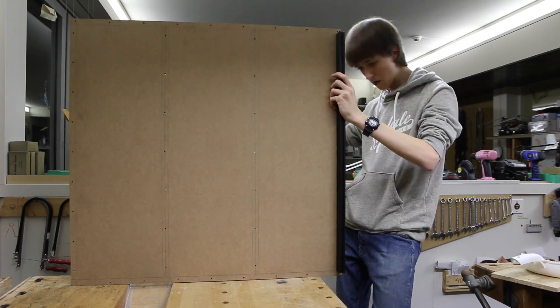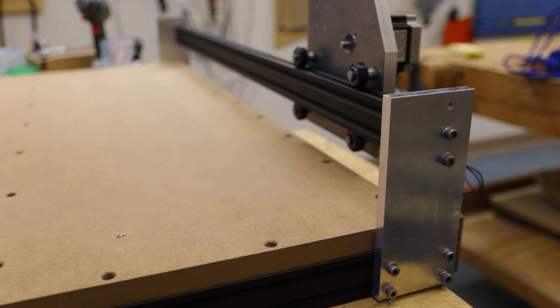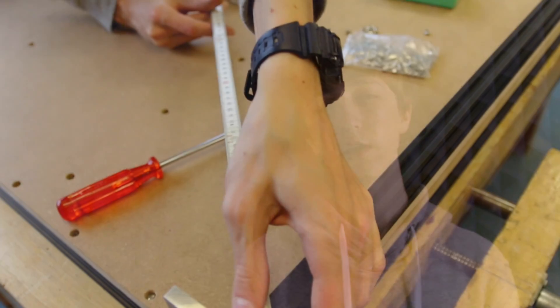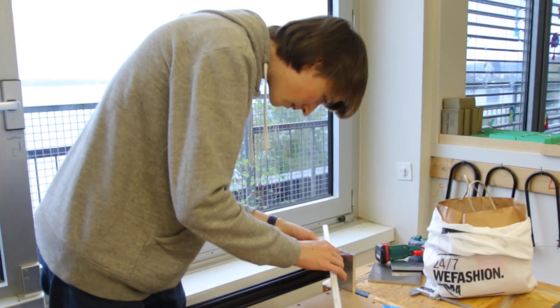After a while I had slid everything in place and it lined up perfectly. I tightened all the screws down and the bottom frame was finished. Florian from Rubiksteam Gaming also came to help me out for this project. With the ground table all done I could attach the plates which hold the Y-rails where the Y-axis glides on. These needed to be perfectly squared to everything, so I attached the Y-rails and made sure everything is straight and perpendicular. I measured the diagonals and used a 90-degree angle to check every angle.